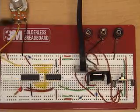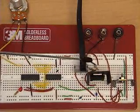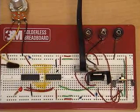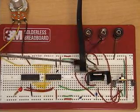Now this circuit is a bit of overkill because we could attach the potentiometer directly to the power op-amp, avoiding the A to D conversion and the D to A conversion. We just did it this way to show how you can assemble all these components and to show how you can introduce a microcontroller into the loop that would allow you to write some control software to do more sophisticated control of the motor.